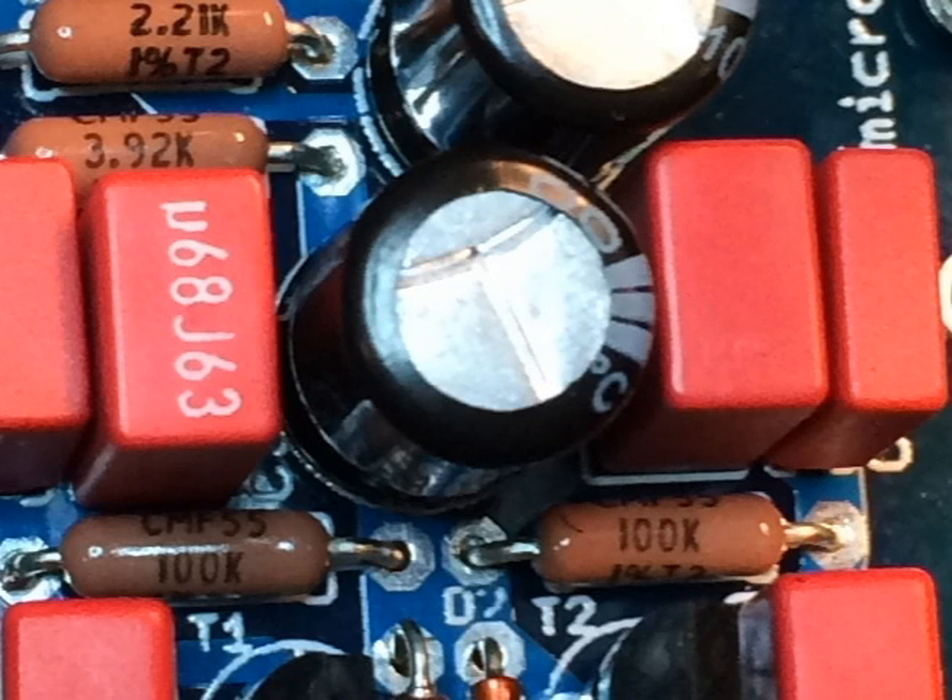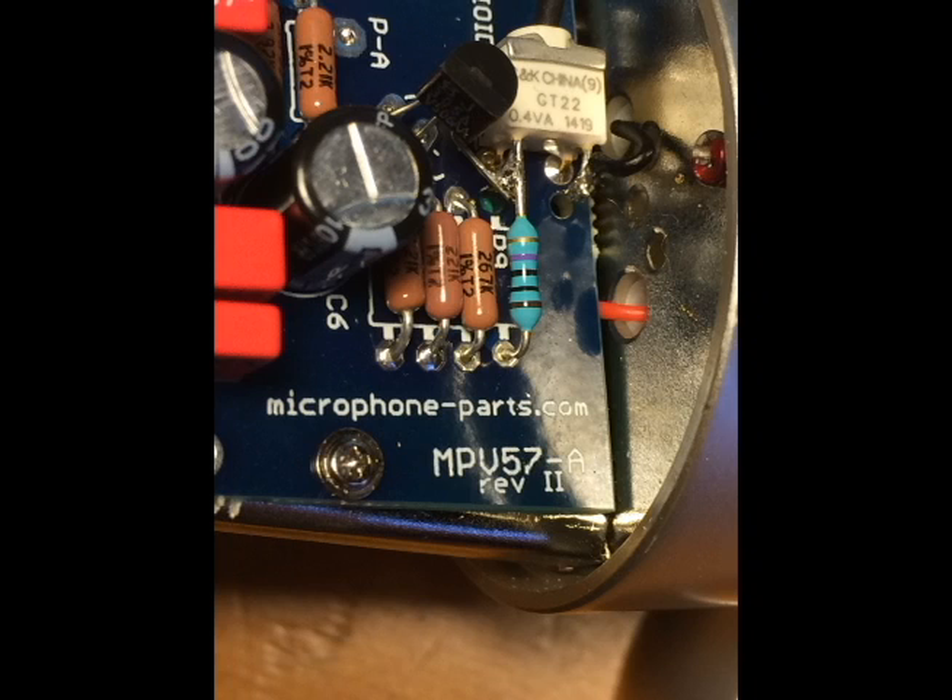After a few emails back and forth — and I'm sure I drove Matt nuts — something reminded me that a lot of times these microphones made in China will change little things according to what's cheaper. So maybe the XLR pinout was different. I went real deep in there with a bright LED and a magnifying glass, since they don't let you take the XLR insert out from the bottom and the lockdown screw wouldn't come out. I was able to see the pinout, started switching the wires around, and voila — here it is.